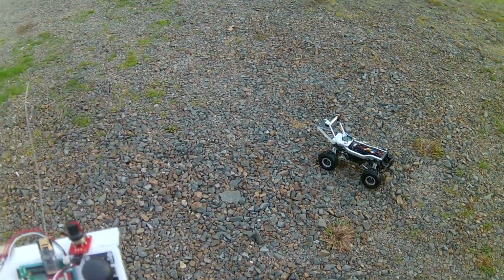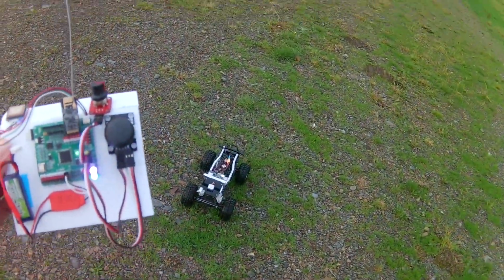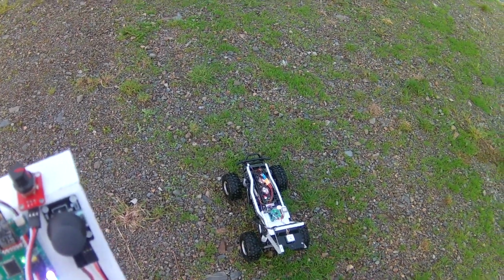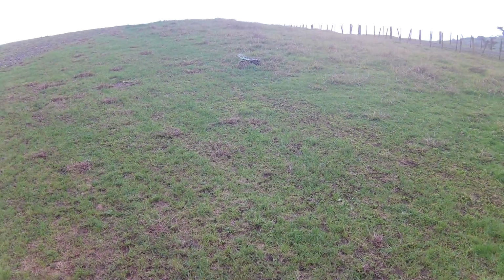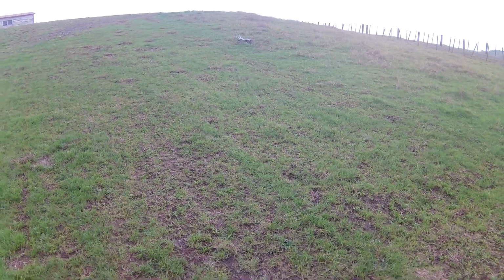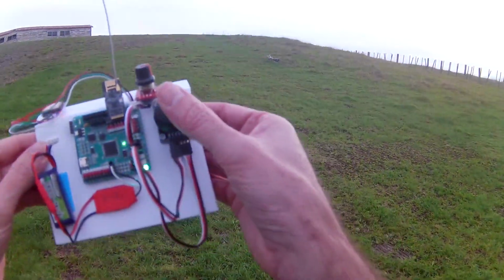Yeah, happy with that. Something that I improved in this version from my old version is that we're now using the accelerometer for tilt compensation of the compass, up or down, but when we go down this hill here, we would have that problem if it wasn't being corrected for. Alright, it was not that much of a tilt, but it's a little bit of a tilt there. In fact, from what I've seen, that much of a tilt would be a good 20 degrees of error with my old system.